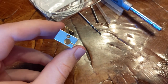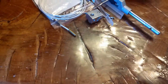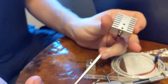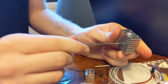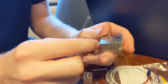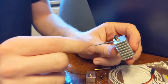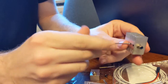The solution to the problem — here are some set screws. This here is one of the worst-designed heat sinks I've seen in my life, from the Sapphire Pro I think it is. It doesn't cool at all — constant heat creep problems. The fins are probably two millimeters thick, and there's so much material around the heat break that the heat probably doesn't even arrive at the fins. So it's no loss.